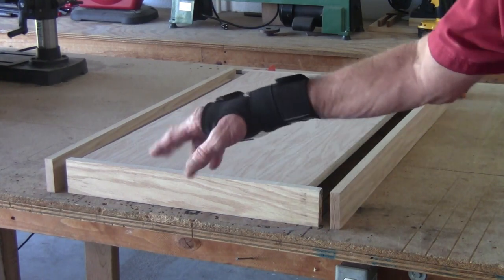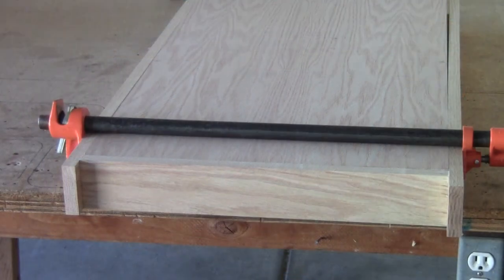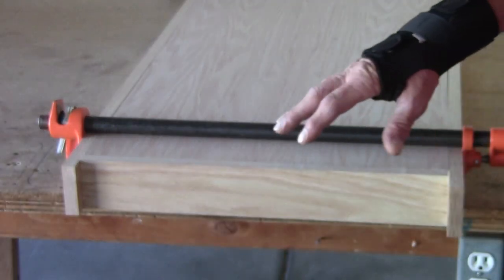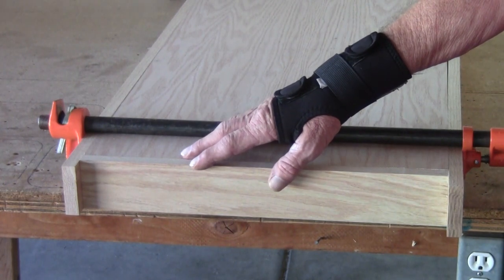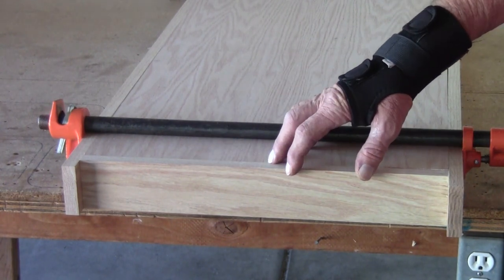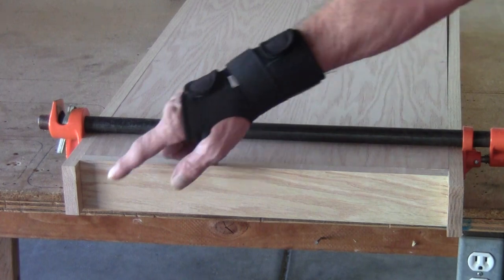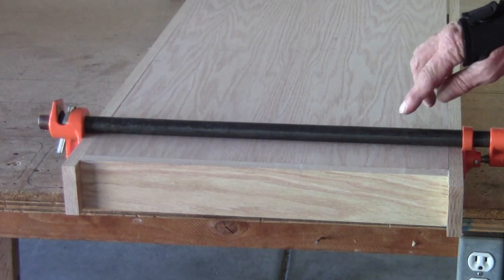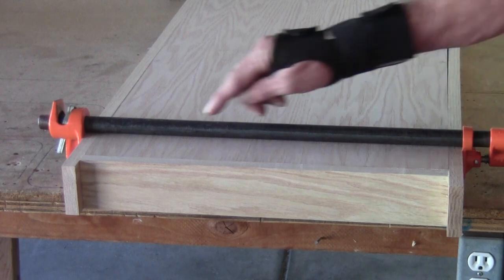First thing I'm going to do is I'll cross cut this. Okay, I went and cross cut at both ends. I had to re-cross cut it a couple of times. Nice thing about a miter saw is you could take off paper thin cross cuts. So I kept doing it until I got the gap out of here and here.